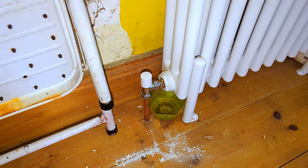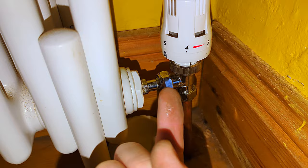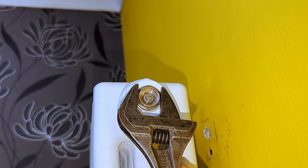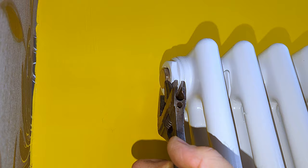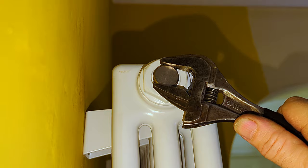That's one radiator sorted out. I didn't film the second one, but I wanted to show you the pots underneath the radiator catching the dripping water, and when I wipe my finger across the joint you can see it's definitely wet and leaking. One last tip: these blanking plugs and air bleeding points at the top of the radiators need to be really nice and tight. I checked these because obviously the other nuts weren't that tight — and as I expected, they all needed tightening up. If left a little loose, the rubber seal will shrink a little bit over time, dry out, and then start leaking in a couple of years time — and I do see this regularly.